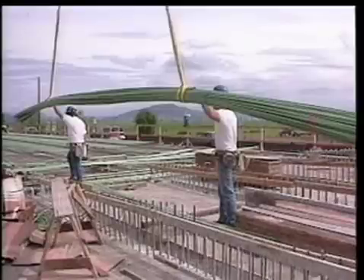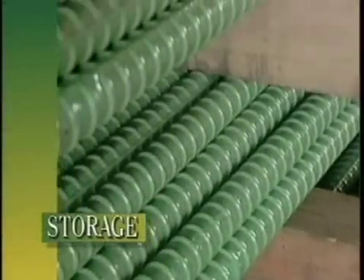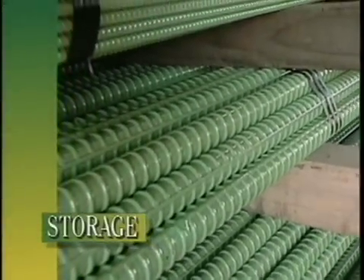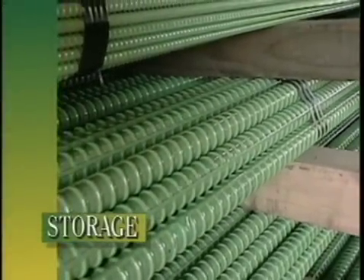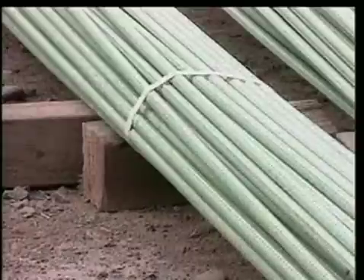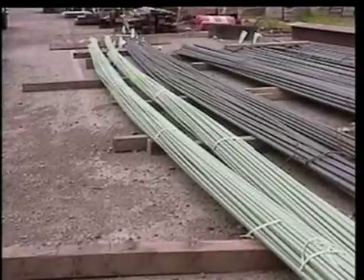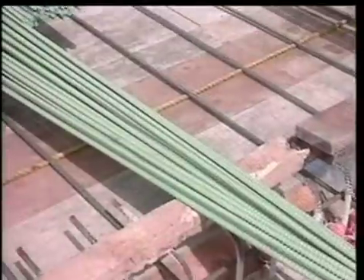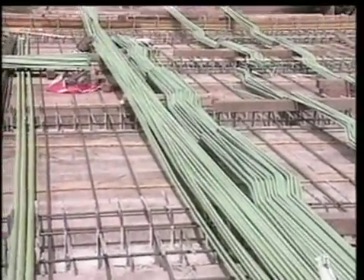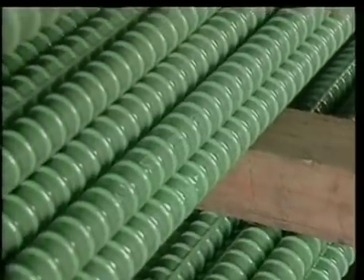This helps to prevent sagging of bundles which may cause bar-to-bar abrasions. When storing the rebar at the job site, always use wooden dunnage or other protective cribbing between the ground and the rebar to prevent sagging. Epoxy coated rebar shouldn't be stacked directly on the ground or on other unprotected surfaces. Remember to allow aisle space between stacks to enable easy access. To avoid sagging, the rebar should be placed on a relatively flat or level terrain with timbers close together.